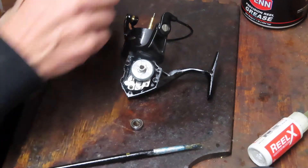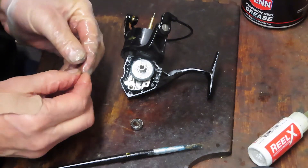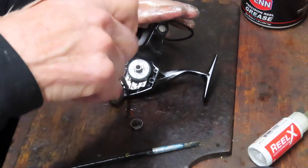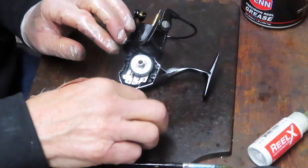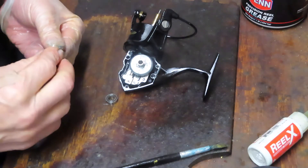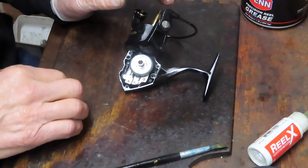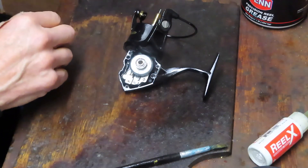This is your screw for the axle shaft. The shim washers go to the inside — in this case there are three of them. Those are used to properly align the main gear with the pinion gear. There's always some play in it and that's usually set at the factory. Put those in next, then the bearing, which will be covered by the side plate. Make sure your side plate is clean.